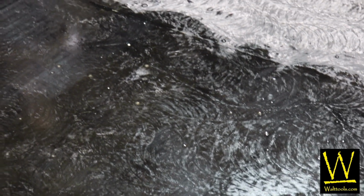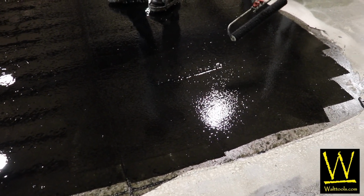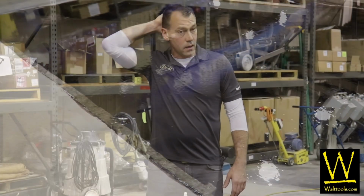Quick and dirty was the urethane to just basically get everything smooth so that we can illustrate the floor without any telegraphing issues. In the real world, I would use an epoxy type product, I'd use a polyaspartic type product, I'd use something appropriate that, though it wouldn't dry as fast as urethane, would be, from a longevity standpoint, correct for the floor that's here, and also make sure that the next layer that goes on can actually bond to it. Urethane, generally speaking, in my experience anyway, if it's not abraded, ground, before anything is put on top of it, has such a hard skin, nothing will bond to it.